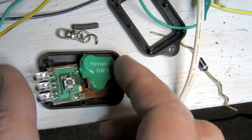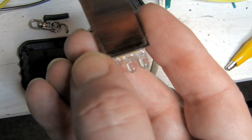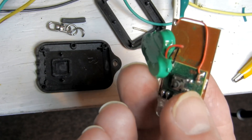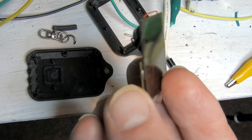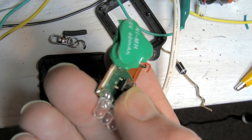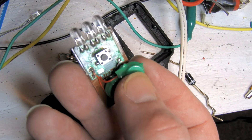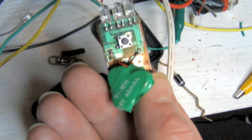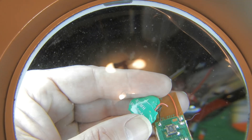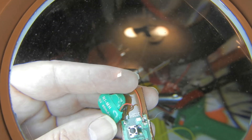It does have a real solar cell in it and it appears to be hooked up. It has real nickel metal hydride batteries, which is kind of a surprise — at least they're rechargeable. It's not any kind of fancy circuit; I don't really see much of a circuit here. Could it really just be that simple? Well, there might be my problem — a wire broke off. Not sure if it was broken before or not, but it sure broke easily. It has one diode on the PC board, that's about it.